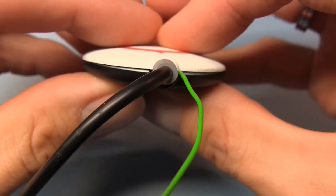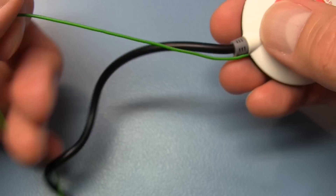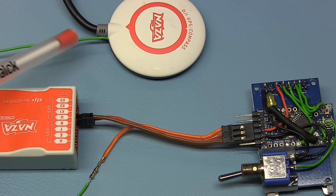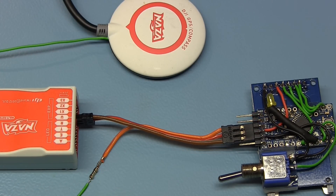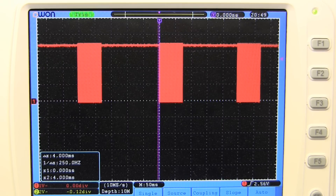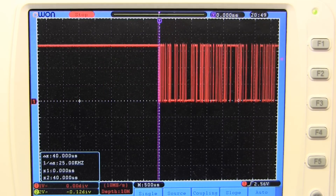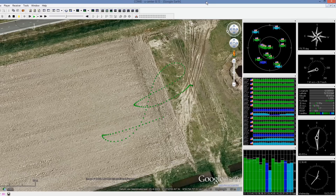It's time to carefully close the GPS and place it back on the multicopter. Don't tighten the screws all the way so there is a little gap for the wire to come out. The other side of the wire is connected to the RX pin of the data logger. To power the logger you can use the 5 volt from the Naza if there is a spare connection available. When we probe the signal on the data logger we can see a very nice 3.3 volt data signal.